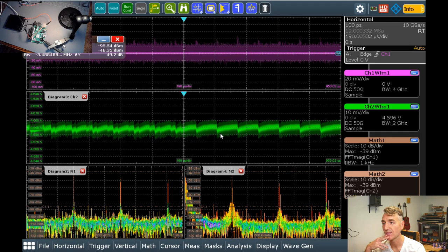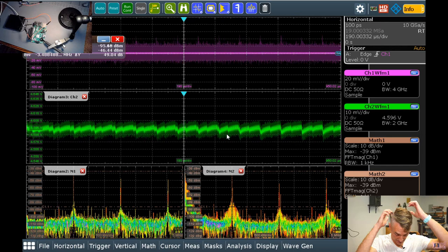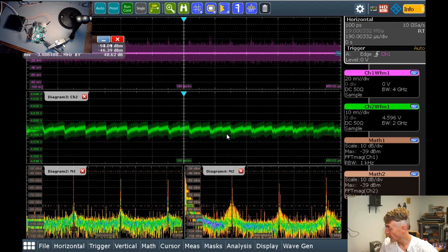The 5-volt rail that I'm measuring now would presumably be after any filtering that occurred, because it is the 5-volt rail available on GPIO. So this would be the rail that you use to power other devices on your GPIO network, or alternatively, that you could use to power the Raspberry Pi with, from an external source, like I am doing right now from my battery pack.